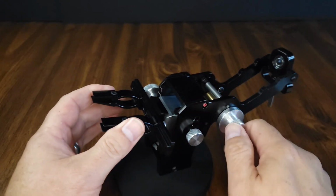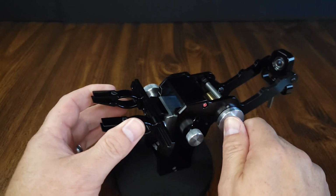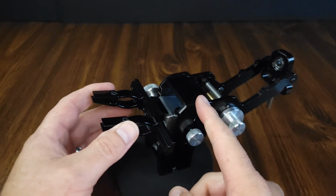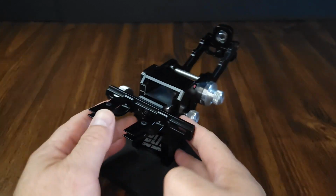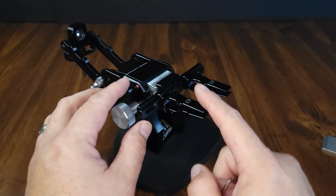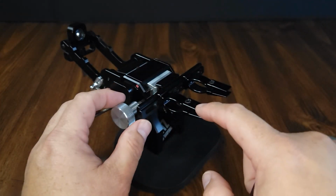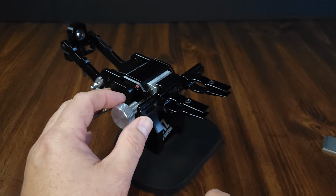I didn't think it was possible until I learned you can just go in 0.5 millimeter increments and get that convex edge for the tough blades, bushcrafting blades, and those heavy duty blades and apexes that you want. So now you know what the features are, what each thing does, and what its purpose is. So now I'm going to show you the clamps and how to clamp in a blade, and let's go up top for that.